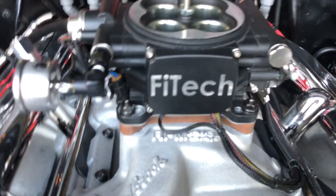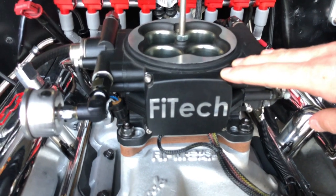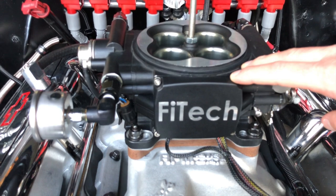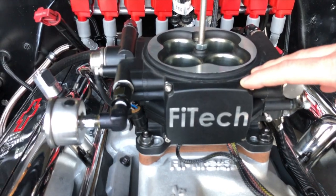This is the ECU right here. I think most people already know that, but that's the ECU. Inside the ECU is the MAP sensor. The MAP sensor is not replaceable — it's part of the ECU, so there is no part number for the MAP sensor.